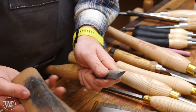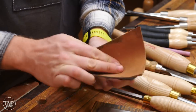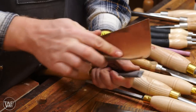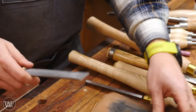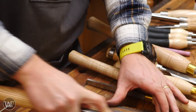And then when I'm really feeling it, I'll just grab a piece of leather that I have with some stropping compound on there and I'll buff on that. Making sure not to pull back and cut my finger — I'm always just pushing away from me on these. And there we go, I have a really nice sharp edge on there. If I wanted to, the buffing compound could be down here and I can do it just like a normal chisel and grind that out.